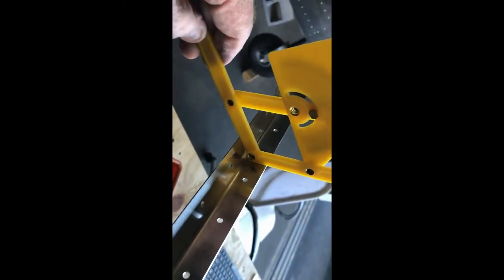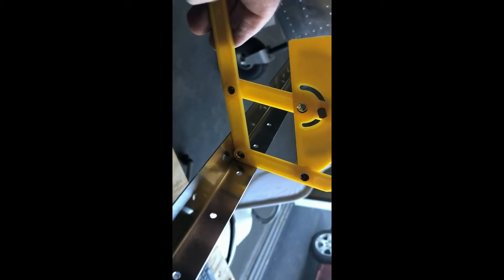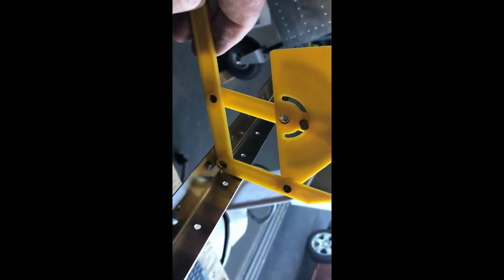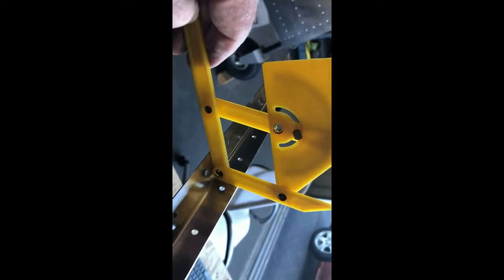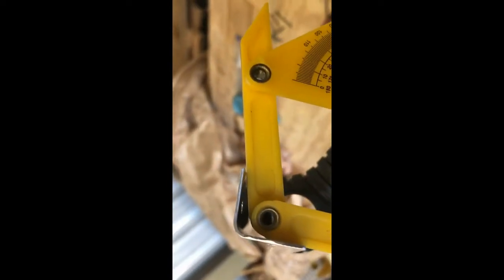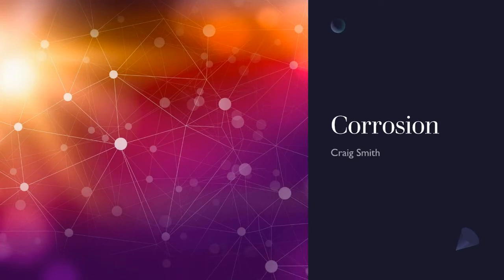The bend radius of those brackets are also different between the top and the bottom to match that aft spar. You can see the difference in the measurement between the top bracket and the bottom bracket of the aft spar. Of course I always check the plans and double check the plans, because that tells you how it goes.